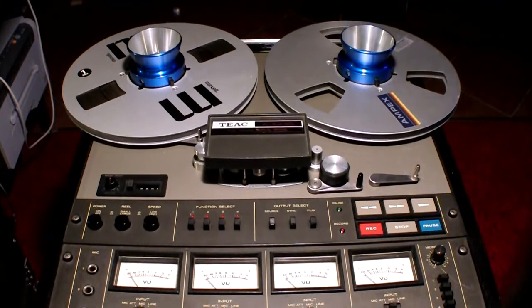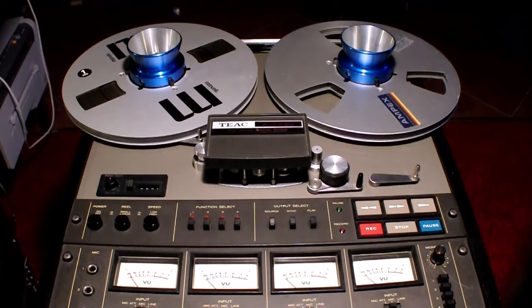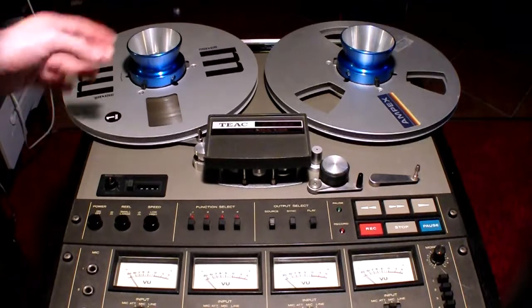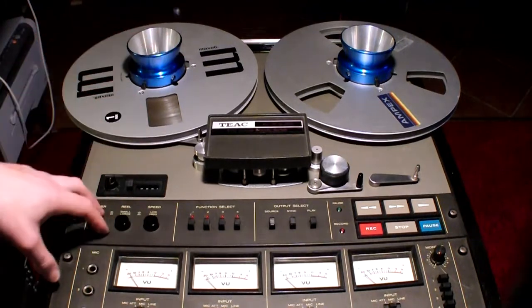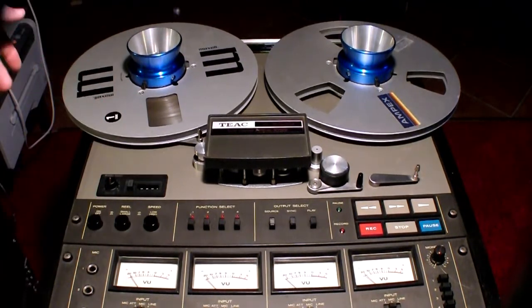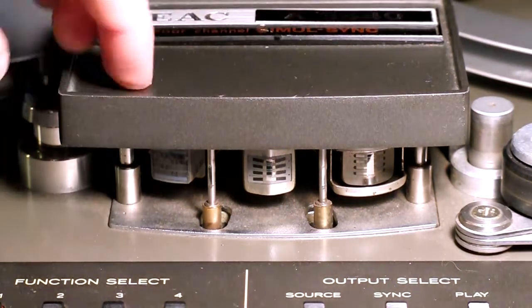So what's the advantage of using reel-to-reel recording equipment versus cassette players? Well, obviously it's the quality you get, because the bigger the tape, the better the quality, and a physically wider tape contains more information. Also, you get less noise. And another big difference between reel-to-reel equipment and a normal cassette deck is that you get 3 heads.